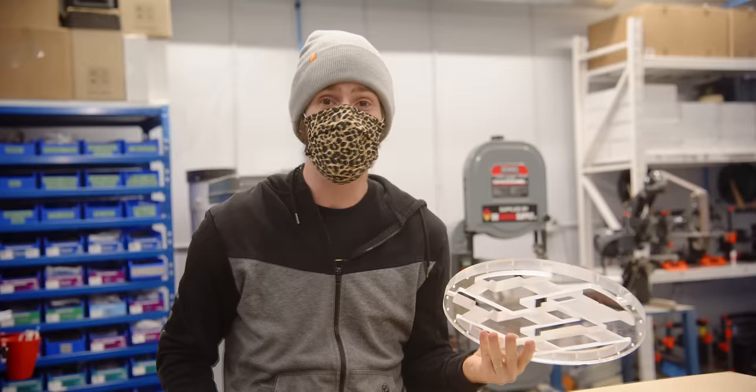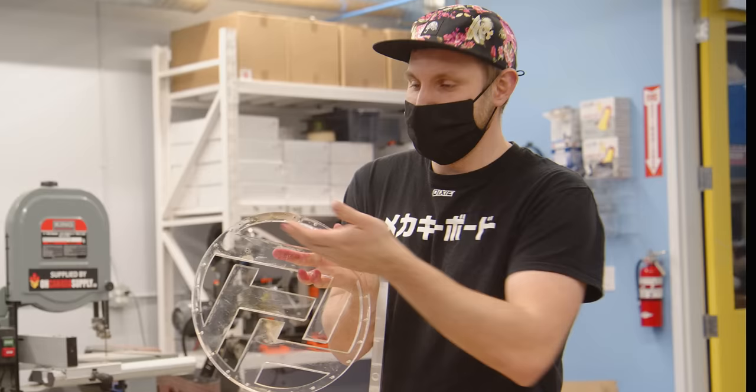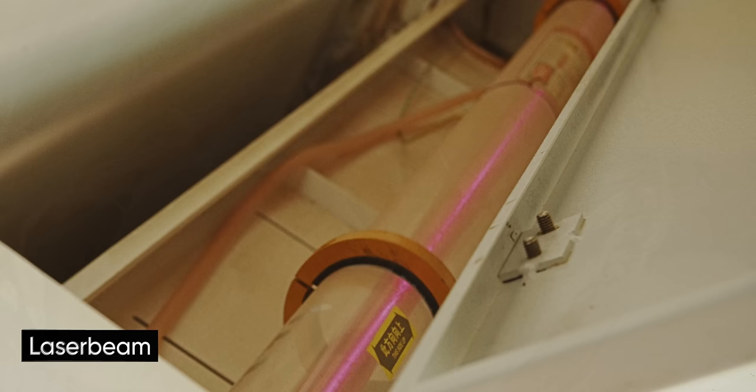A lot of my experience is with metals, which are much more forgiving to work with. On my shop laser, I just couldn't get the cut right. I couldn't get the settings to not light itself on fire. It's something that I could have probably dialed in, but I decided to move on from V1. Vaporized acrylic likes to get a little burny. And given the 10 watt per millimeter rule of thumb, 130 watts of power for 18 millimeters of acrylic is pushing the limit a little.